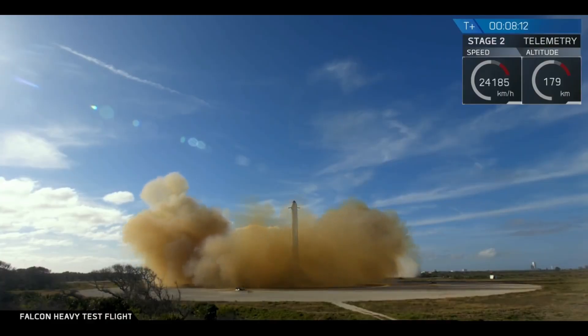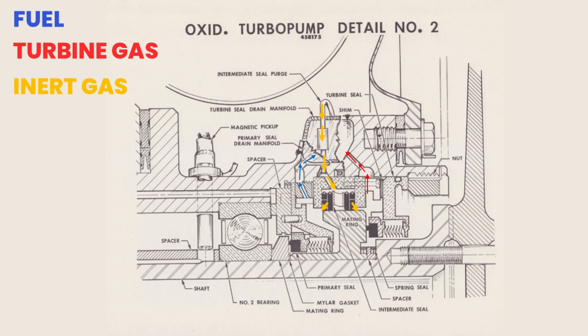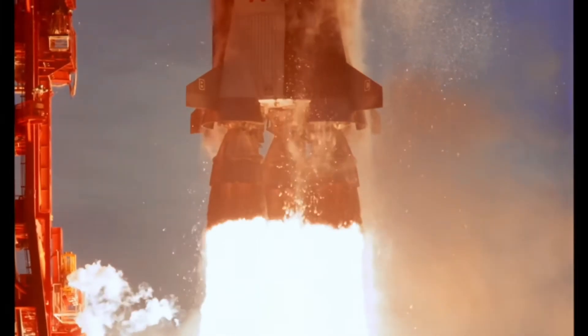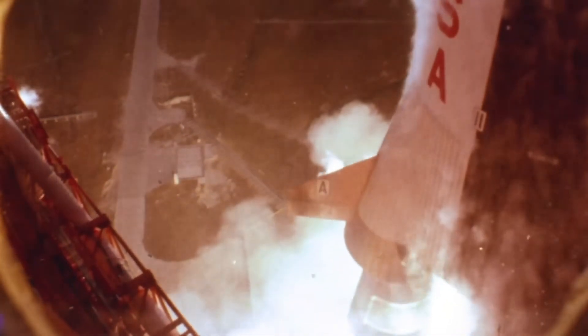On the other hand, significant challenges remain. Development costs and technical risks would be high, and sealing between the hot turbine gas and the cold fuel — two fluids that must never come in contact — would be a critical problem. In summary, we have seen how turbine blade cooling is applied in turbofan engines and why directly transferring that concept to rocket engines is not feasible. Conventional designs face issues with centrifugal forces, complexity, and safety, which is why active cooling has never been adopted. The patented turbopump concept offers a potential solution by integrating the cooling path directly into the combined turbine-pump stage, enabling much higher turbine inlet temperatures, reduced mechanical losses, and efficiency gains of up to 15 percentage points. Whether such a design will become practical in future rocket engines is still uncertain, but the potential benefits are clear.